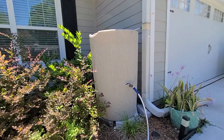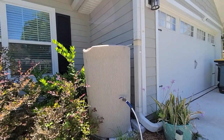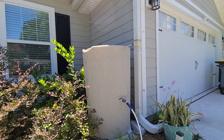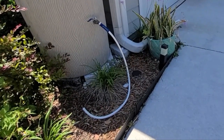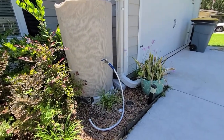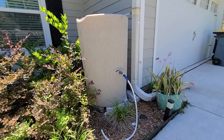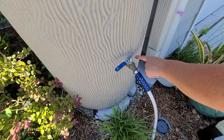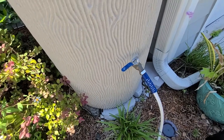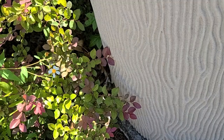In the front of the house we have a different kind of rain barrel that I purchased on Wayfair — glad I found it on clearance. It allows me to hook up a bypass hose, which you can see just above the top of the barrel. We cut the downspout in half and inserted this bypass, so not 100% of the water comes through; the downspout continues out onto the driveway for overflow. I don't have a water faucet at the very front of the house, so this is really nice for watering houseplants around the front door. I replaced the faucet that came with it with a ball valve for a much stronger water flow, and there's also the original faucet down below if I need to connect a hose.